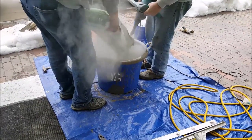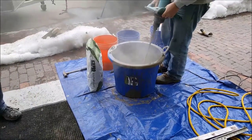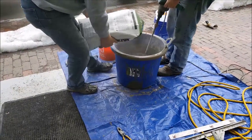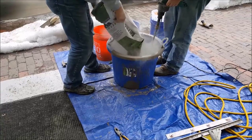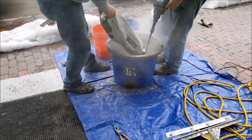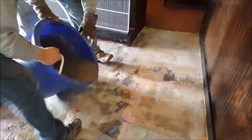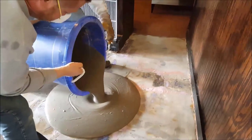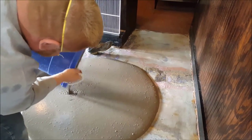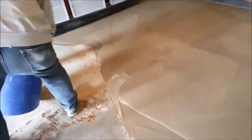We do quite a bit of this stuff. If you want to learn how to do all this, check out my link for the Concrete Underground below in the description. Inside that private training area, I have trainings that teach you how to do all this type of stuff. We're mixing two bags at a time — you can mix one bag if you want — but we had some areas we had to build up that were about a half to five-eighths of an inch thick, so it made the process go a little quicker doing two bags at a time.